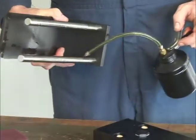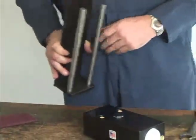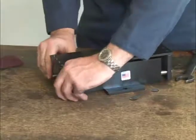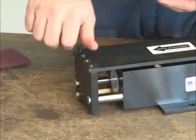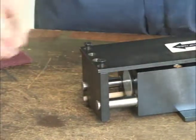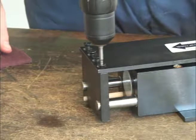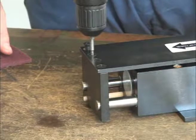Now install the carriage rails. Lubricate the rails and the bearing openings before reinstallation. Replace the end plate and reinstall the four cap screws. Be sure to place the two longest screws in the outside openings; the two shorter screws are inserted in the inside openings. The longer outside screws provide for single-tray attachment. See the owner's manual for single-tray attachment.